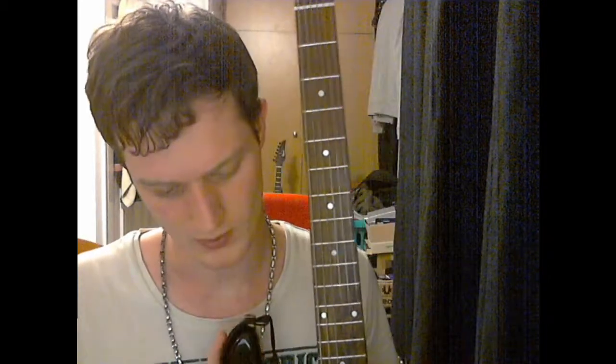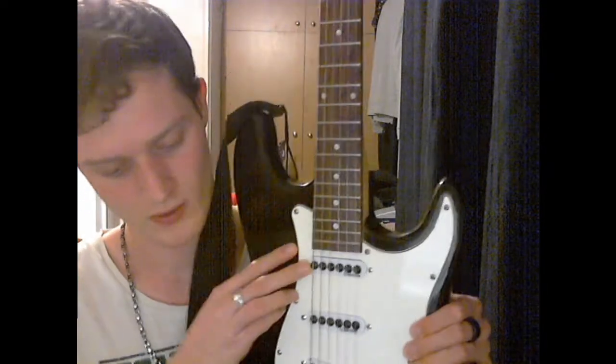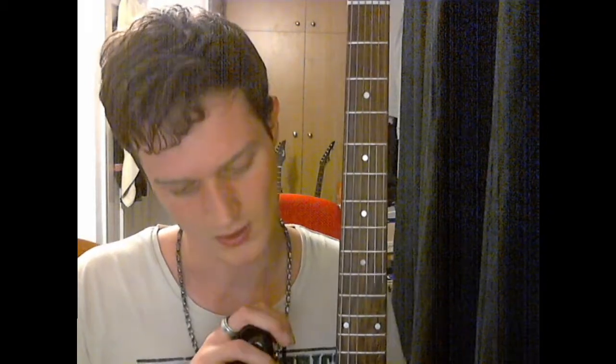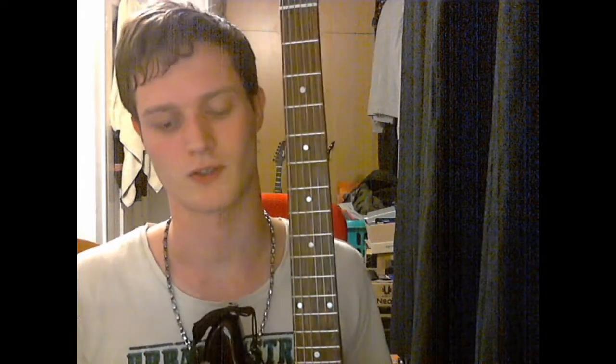I can't remember what it said on the website, but I measured them, and the neck has 5.7 kilo ohm, the middle has 5.79 kilo ohm, and the bridge has 6.36 kilo ohm, which is much higher than the 4.4, 4.4 and 4.3 kilo ohm of the original pickups. It's like 25 to 40-ish % more resistance, and therefore more output, because more resistance means there are more windings of the coil in the pickup, which gives a higher output of the signal when you play the string.